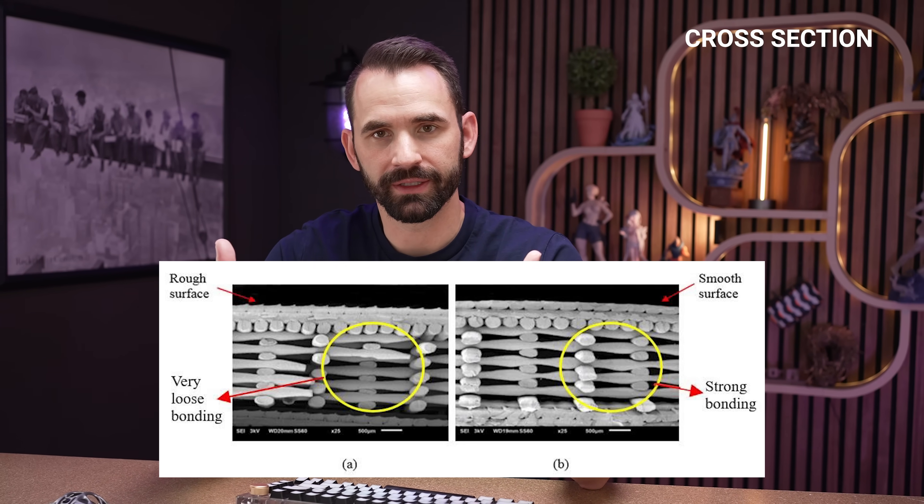The reason we need to focus on lift height is because a larger release film has more material to stretch and therefore will stretch more. So you're going to need more lift height to make sure you release every single layer from the release film. For light off delay, larger printers are going to need more and more. Larger cross sections — either from printing more things at once or printing larger things — and that huge build plate compressing resin over a large surface area all require more light off delay to let the resin squeeze out and reach your target layer height before curing.